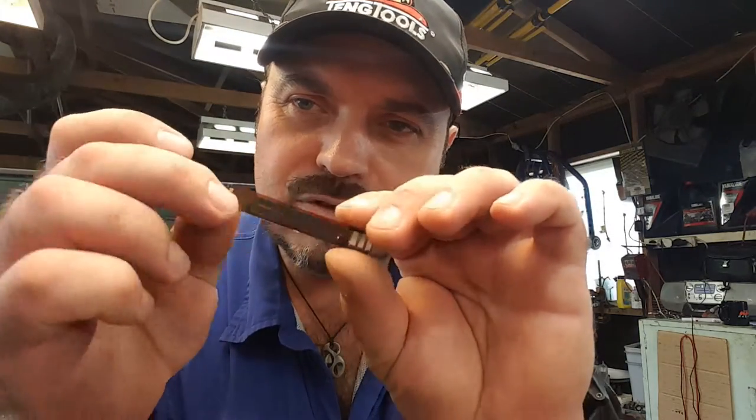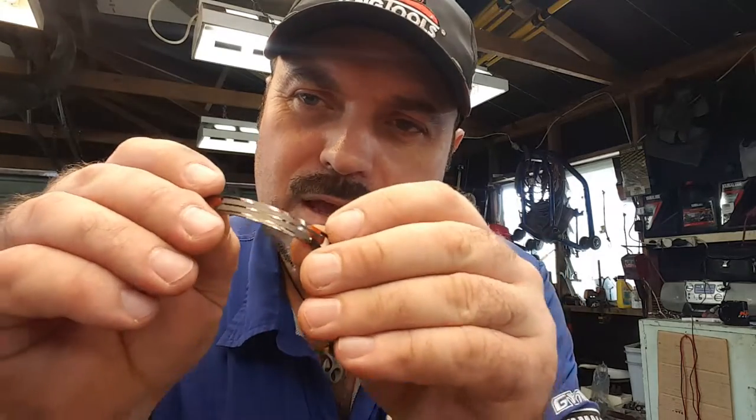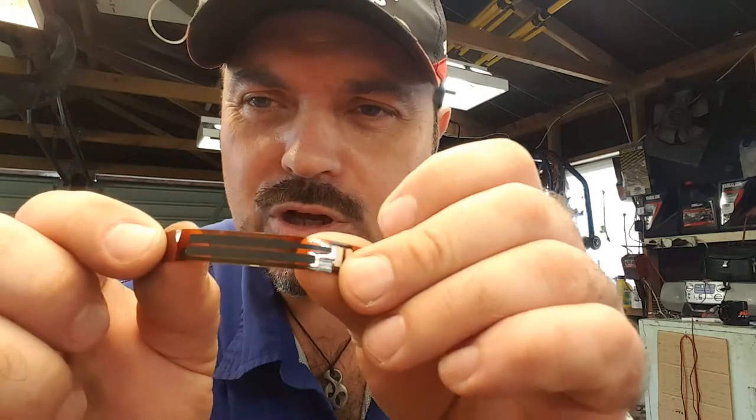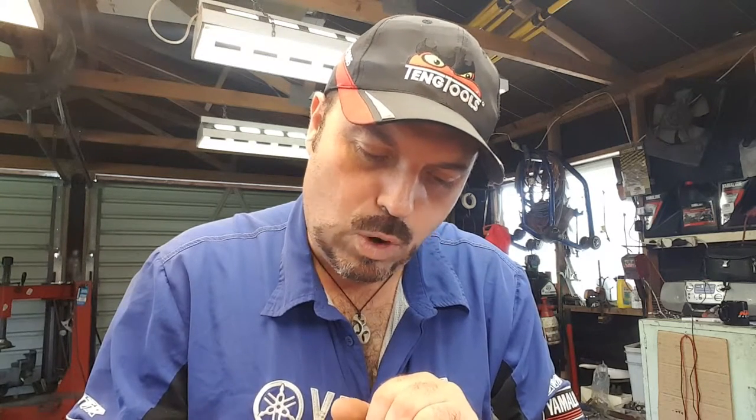Just as a recap — inside we have the track, or pair of tracks. These things are not repairable; I'm not pulling it apart to try to fix it, just as an explanation of what's inside. Those are the two contact strips and those are the two little arms — they just act as a join because it's all one piece of metal. Those two little brushes run up and down those tracks and introduce more or less of the resistor. That track is the resistor in the circuit: the more of the track in the circuit, the lower the output voltage; the less of the track, the higher the output voltage.